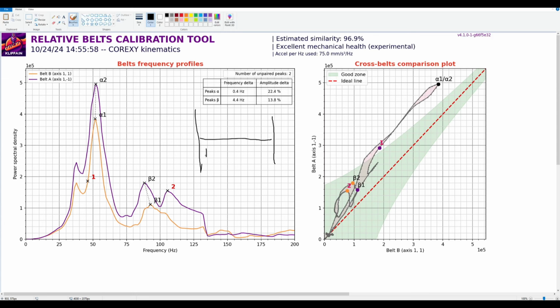If I do a little movement here, this is going to come up a little bit. It's just going to happen. It's going to rack a little bit when we're tightening these belts. Then I do a little movement here, this is going to come in a little bit. Hopefully at the end of moving them back and forth, I'm still at the same spot, so I've kept my x-axis perpendicular. But if I make a big movement, and then a little movement, and then a big movement, and then a little movement, I'm now racked.